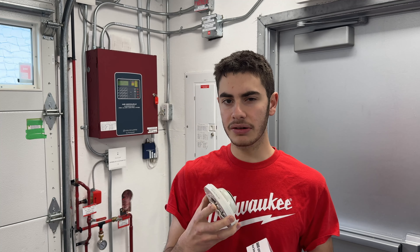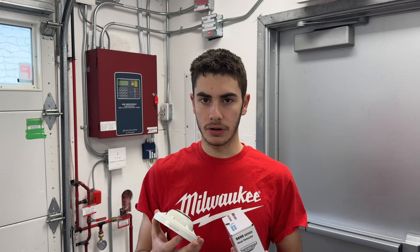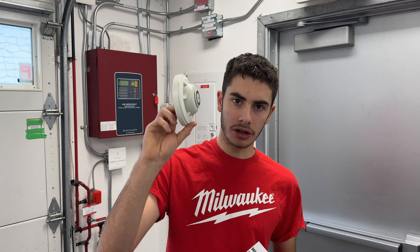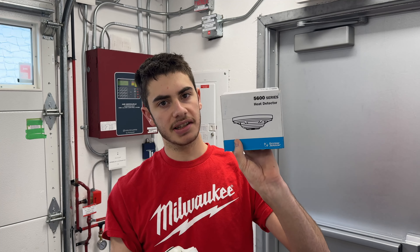The device in question is a mechanical heat detector. I have mechanical heat detectors in the attic. I didn't go addressable because I didn't want electronic equipment up there exposed to harsh conditions — really cold in winter, really hot in summer, potentially humid. I've seen that cause problems with addressable devices. I'd rather have conventional mechanical heat detectors and a monitor module down in the conditioned area monitoring that two-wire conventional zone.